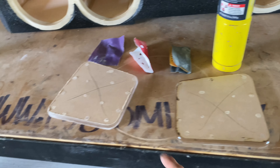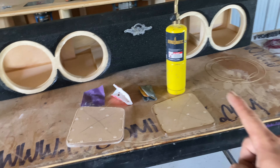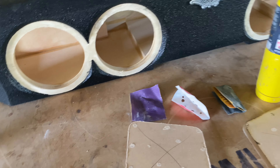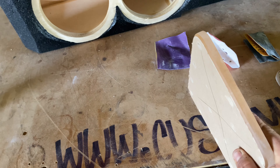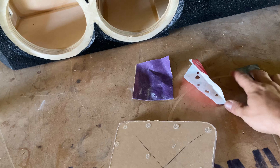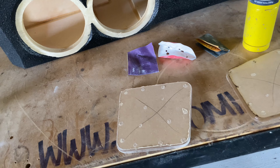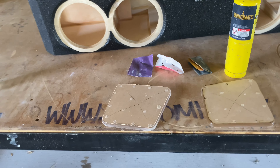What I'm doing is taking 150, 320, and 1000 grit sandpaper, and some heat, working through the progression. Ideally I'd go 150, 220, 320, 800, then flame, but we're working with what we've got and it'll do a plenty fine job. You will see me going back and forth between the 320 and the 1000 because I'll find scratches that the 1000 won't take out — it's quicker to run back with the 320 on that spot, then touch it over with the 1000.